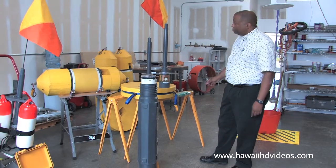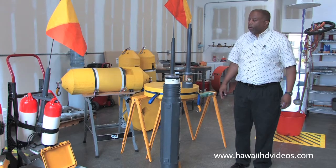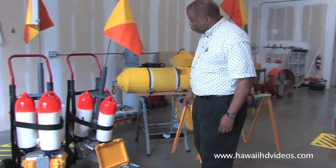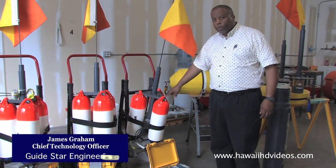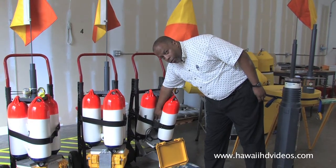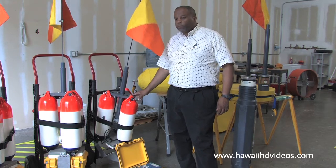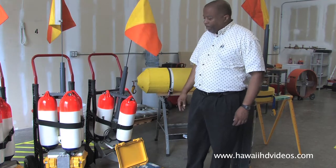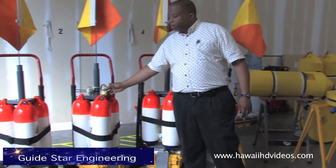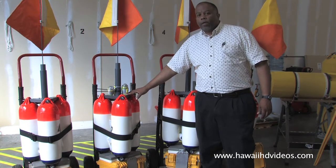The rest of the equipment you see here are two different types of buoys to put in the water and float there to listen for marine mammals. Our first buoy is meant to stay out in the water 24 to 48 hours. It has the same electronics in the center surrounded by floats so the electronics will be protected and no marine mammals will get trapped. At the bottom it has a battery case, and on top a radar flag so we can find it, and strobe lights — necessary for location and for Coast Guard regulations so that boaters don't run into them.